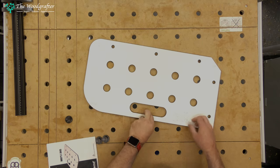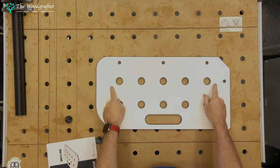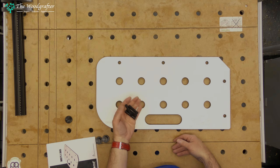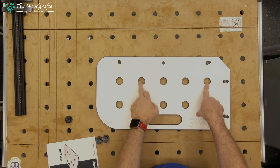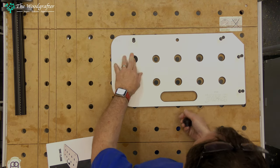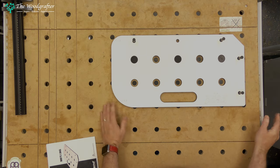This is an MFT jig — it's pretty heavy. It's basically a jig with 30mm holes inside it. You use a 30mm bush that sits inside these holes and a 20mm router bit, which perfectly lines everything up. It comes with a number of pegs that slot into these holes so you can align it to the corner of a square piece of MDF and cut your first set of holes. You then use the supplied dogs — 30mm on the outside, 20mm on the inside — drop them into the holes you've just made, and drill your second set. Move forward, and that's guaranteed to give you a 20mm grid.